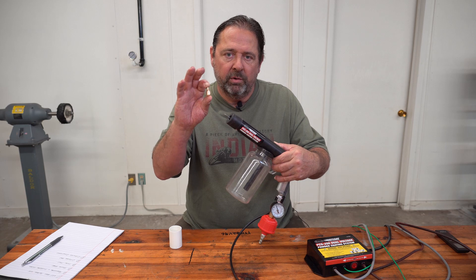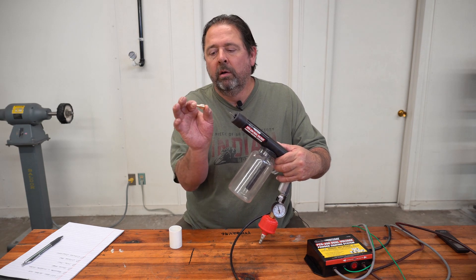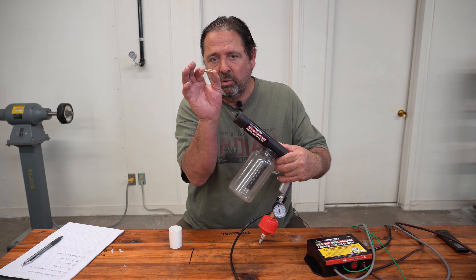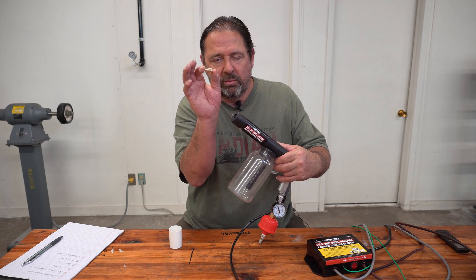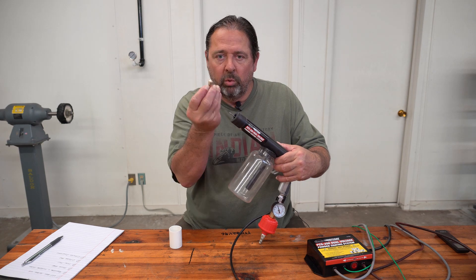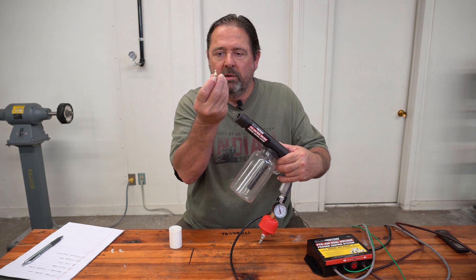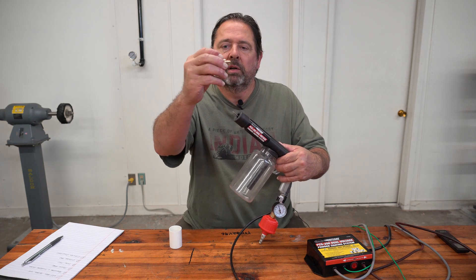Now this diffuser is made out of brass. It's one inch long, half inch in diameter. If you see that seam right down the center — that small crest — that's half inch both ways, right in the center. On one end I have a quarter inch radius, and on the other end where it goes onto the electrode is just something to help diffuse the powder.